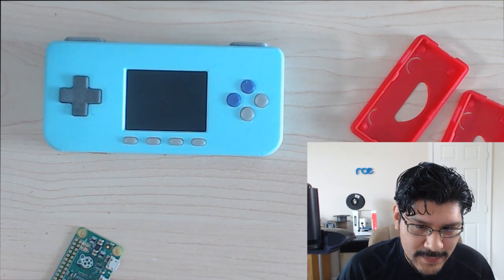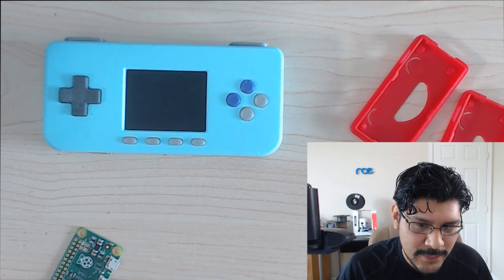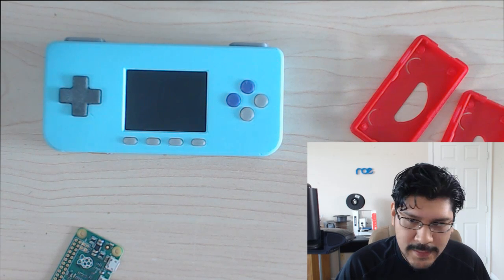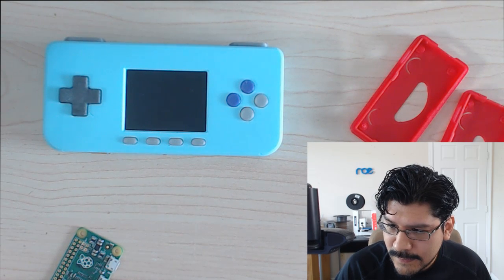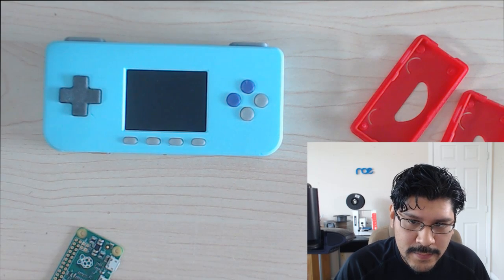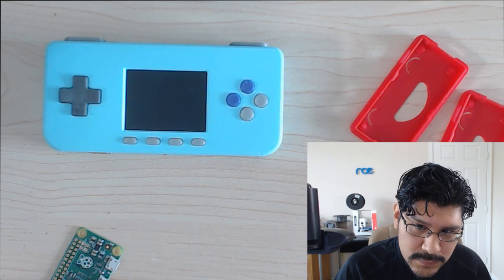So what I'm going to do is I'm going to delete this from Octoprint. And I'm going to show you how to save it out of Autodesk Fusion. So I'll save this bottom half because that's the one that actually has all the ports and stuff. Right click on it, save as STL, and the refinement's at medium because it's a simple case. You could do an output here where you send it directly to your slicer, but I like to save it out for saving it local purposes. So I'll save it here.